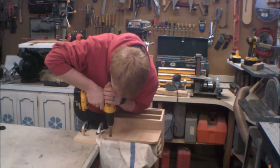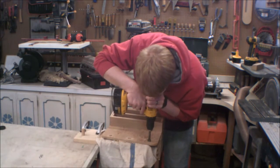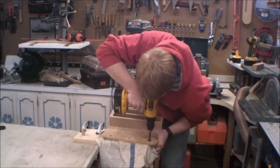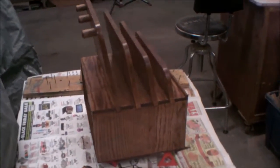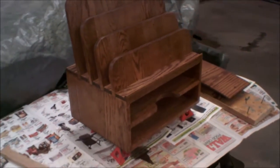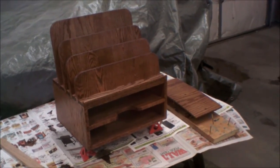For the final piece of carpentry, I'm drilling the holes for the dowel pins on the back to sit in. I have my project supported so that I can drill straight down. For the finish on this project, I went dark — this is an American chestnut stain. It helps hide some of the imperfections from the reclaimed wood, as well as bring out the beauty in that oak.